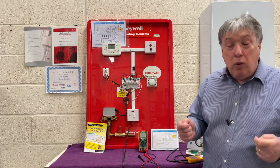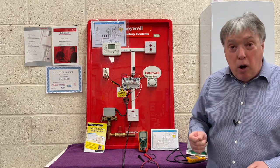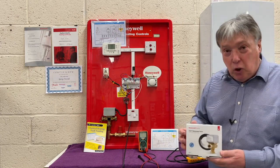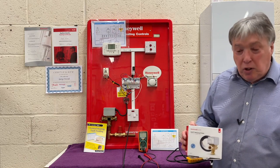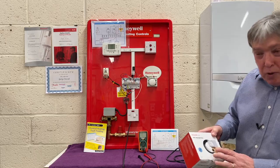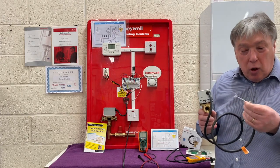That's an important step forward — make sure if you're installing this, it's a mid-position system that you buy. When we look at the box, this is the latest version. The old one used to be all red with big writing on. Inside you'll get the latest valve and the wires, which I'll go through shortly, and it tells you everything you need to know. Remember, it must be earthed because it's metal.